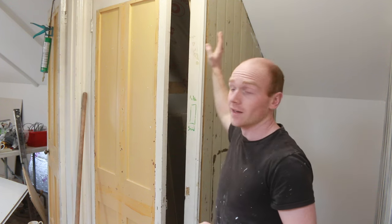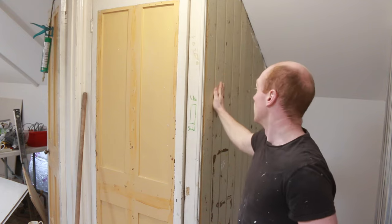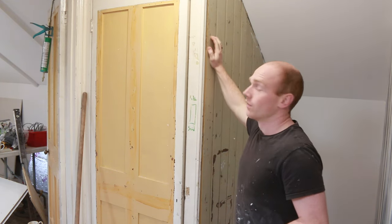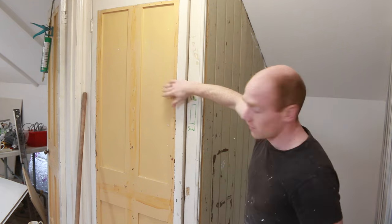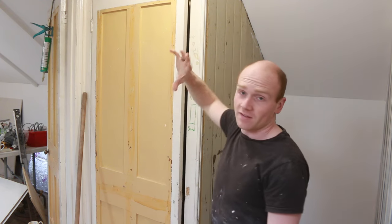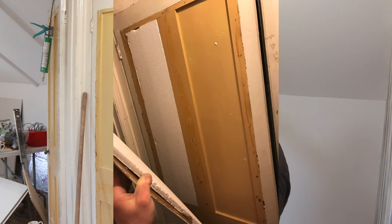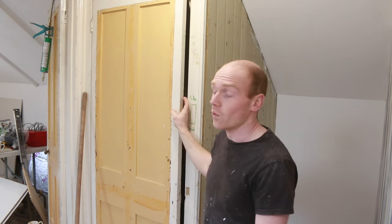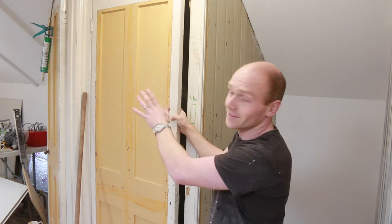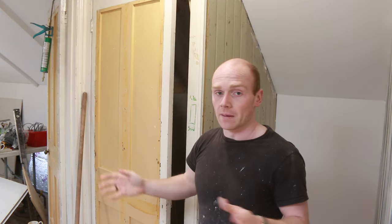What I was doing last night is this structure - an old cupboard with original tongue and groove cladding on the side, but it was just covered in wallpaper, polystyrene panelling for insulation, and all sorts. I've just been scraping everything off to get back to the painted timber. This door was covered, like all the other doors in the house, in a sheet of hardboard back in the 70s - gloss white over the whole lot. We've pulled off the hardboard and uncovered a nice four-panel door. There are dozens of nails to pull out, fill, sand, and paint, and I'm probably going to take the doors off and do them out in the garage so it doesn't stall what we're doing up here.